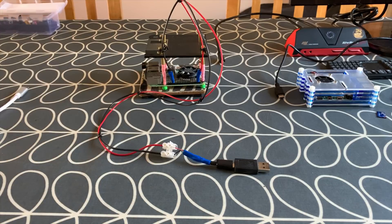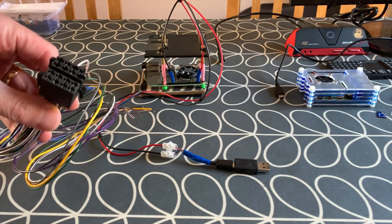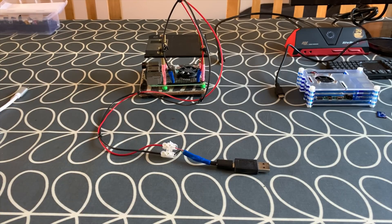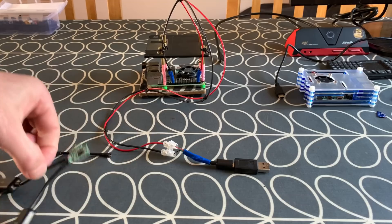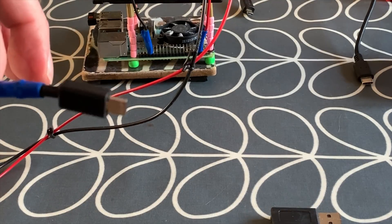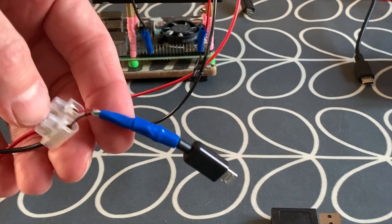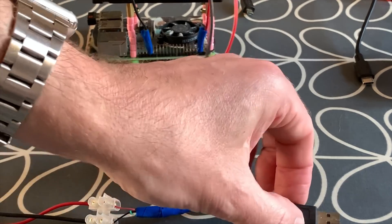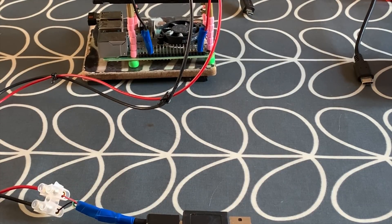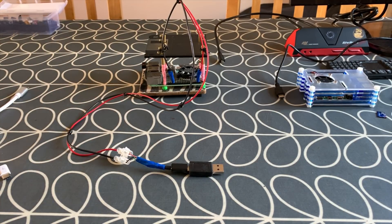I needed to get little pins and I didn't have any, but I found a car wiring loom in my garage which I'd had for ages, so I took out the red and black cable very neatly with some clippers. I also had a USB on-the-go adapter which has never worked, so I took the little micro USB off that. You can see I've got the red, black, white, and green — which is for data, so I don't need that, I just need power. I connected it up with little block connectors, and then I've got a micro USB socket to USB-A so it can plug into my power adapter. I also have a micro USB to USB-C adapter for power adapters that use USB-C.